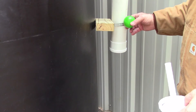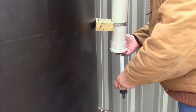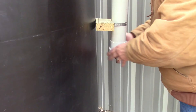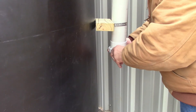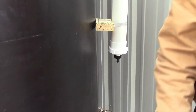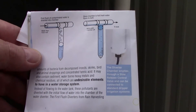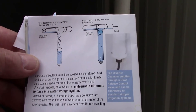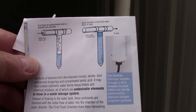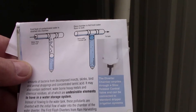It has a check ball in it. When the tube fills up with water or dirt, this little ball will rise up the tube and there is a seat up there that the ball will seal against. As water is rushing into the tank, it will not create a siphon effect because that ball is blocking the seat area. This little diagram from the instructions shows how that first flush works with the ball that rides up against the seat in that tee.